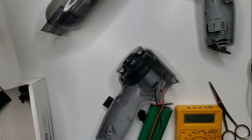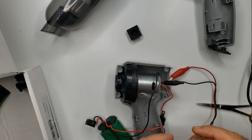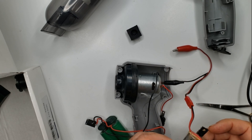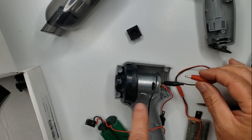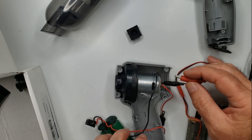I'm not really thinking a whole lot's going to happen with that motor anyway, but let's see if I can dig up two lithium cells — maybe not a perfect match, but some matched cells that are close — and see what we've got. Okay, I'm back. I topped off a lithium pack that's in series, so this is 8.4 volts. I connected the negative to the negative on the motor and I'm going to touch this right here rather than go through all the wiring, because I don't think it's going to be worthwhile doing more than this.